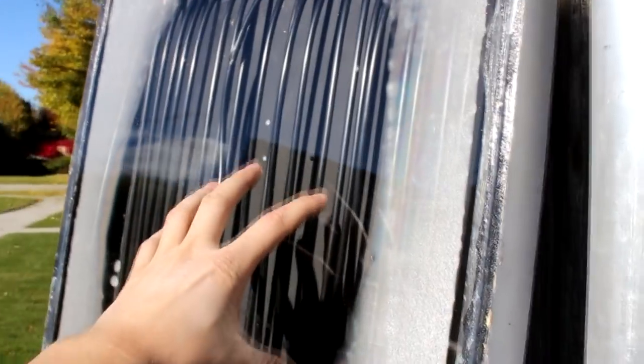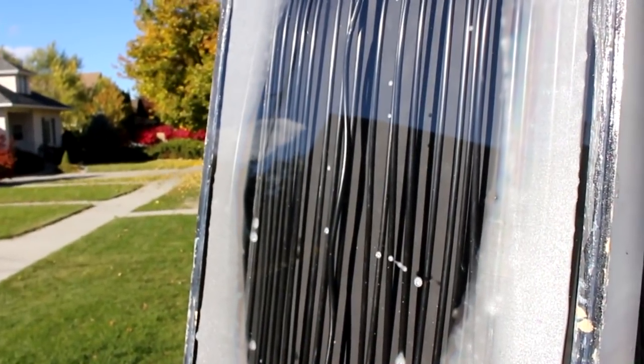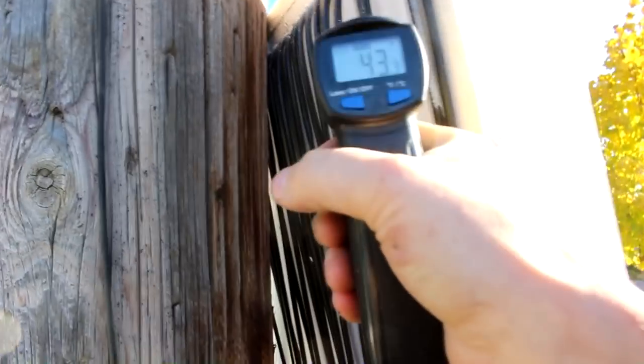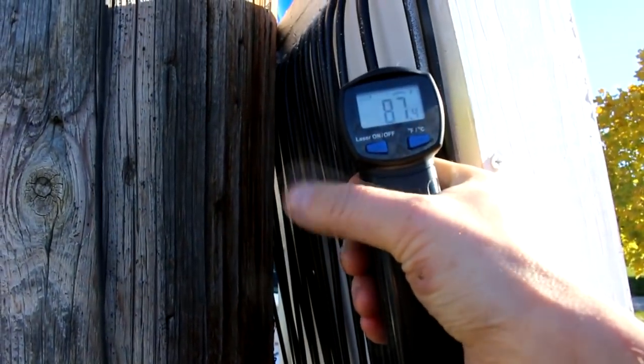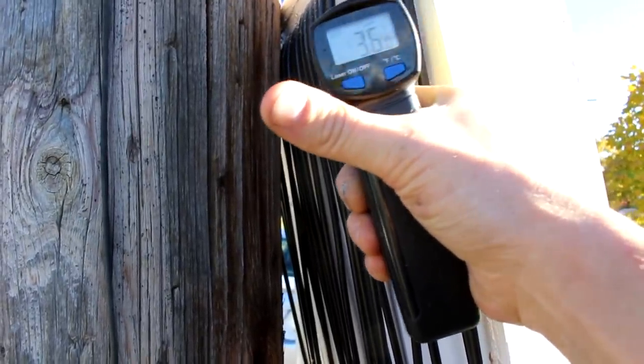You see, in order to pump through the amount of liquid that's in one of these tubes going up, to pump that volume up, it also has to heat not only that much of the cold water, but also that much of the cold water that was on the entire back side. So in order to move just one of these volumes, which might be around 10 milliliters, it has to move 22 times as much. See, around here on back, the tubes are still very warm, almost 100 degrees there, 37 degrees centigrade.